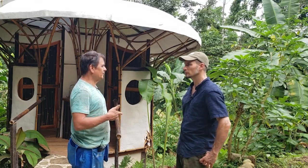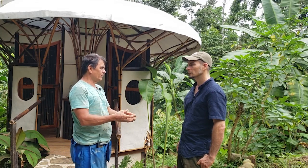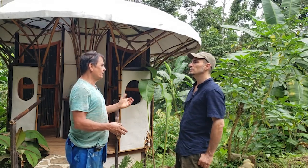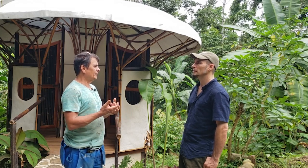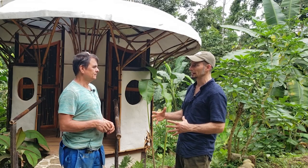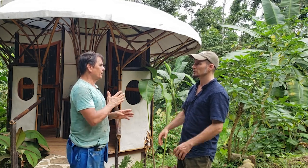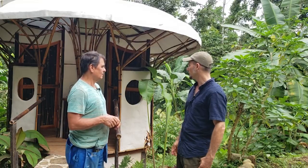You mix the lime with soil and sand, and you make some kind of concrete, with lime and sand. Then you put the post in that, and you put rocks around it, and you have a post that breathes in the ground. It's less humid. So the post is in the ground, but not touching clay, because the clay's always got moisture bringing moisture to the post. The mix keeps moisture away from the post. Brilliant. I love it.